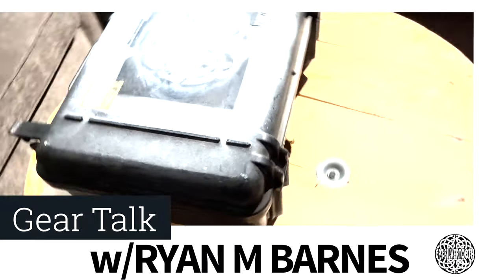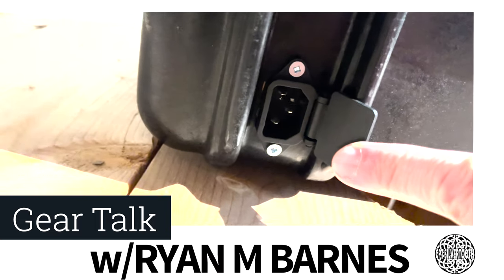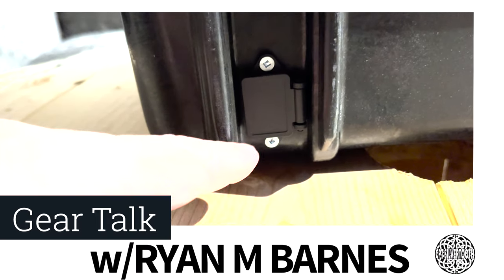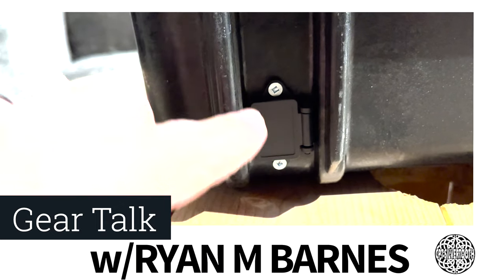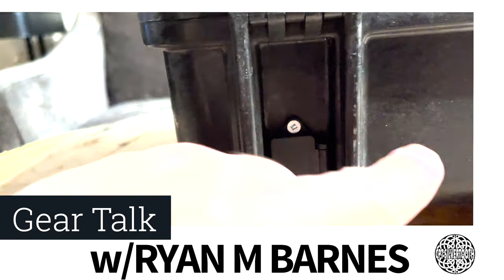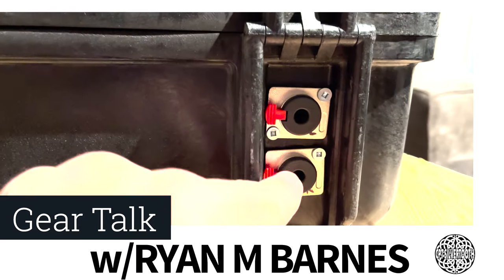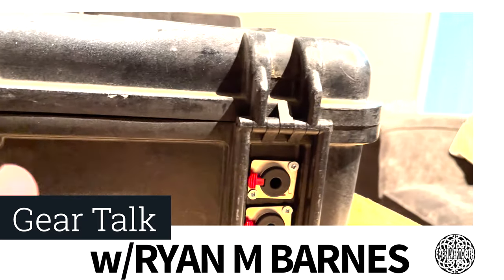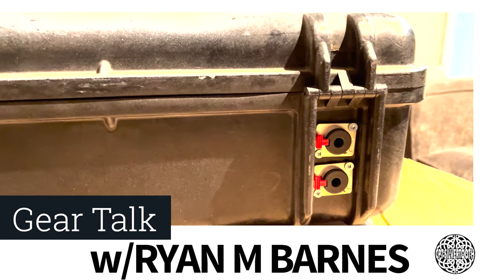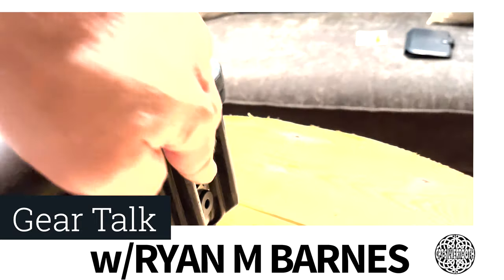Starting from the outside, I added a power jack to make it really easy — I used a universal power jack with this little weatherproof stopper. This is the only thing I had to buy; everything else I had on hand, and these were about 12 bucks for a 10-pack — really cheap. I put it inside these grooves here so that when it's in my car and bumps against anything, it wouldn't knock this out and it wouldn't scratch. Over here I put a couple of TRS jacks because I wanted stereo input. This can be the line out from whatever board you're using — whether it's your own board or a house board — just quarter-inch TRS, tucked inside so it's not scratching anything.